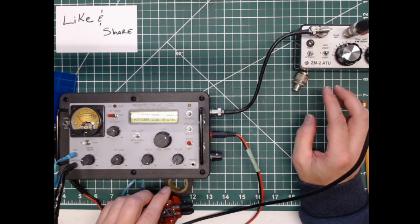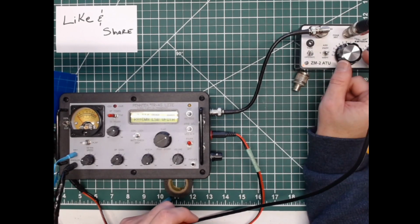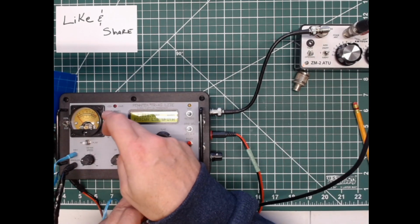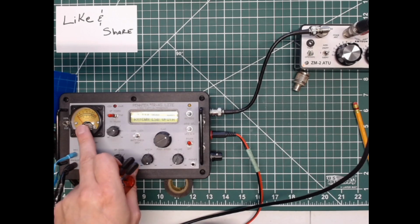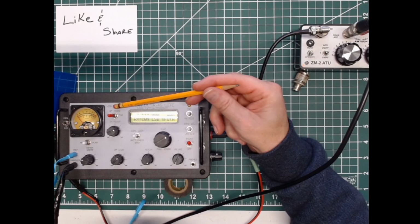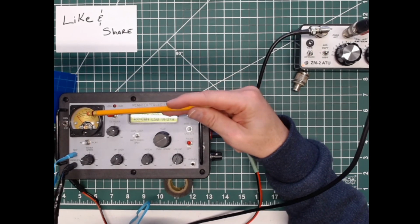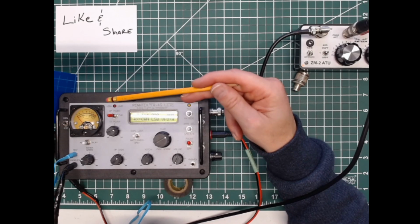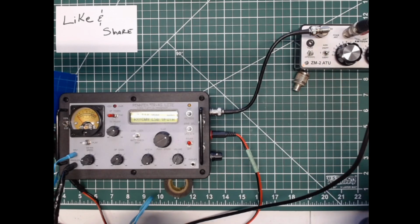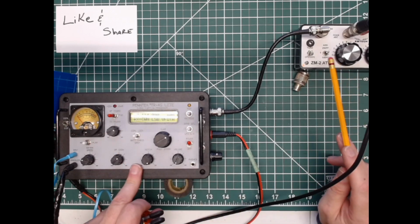All right. Well, so you get an idea there how I used the tuner. Basically, the light didn't go all the way out this time. However, I did notice that when I flipped my meter over to SWR and I keyed down, I was able to watch my meter over here, and it laid pretty flat. And again, this light will come on if it's over a 2-to-1, and then that needle right there will come up as well. But we noticed that my needle is flat, my light didn't come on, even though that light was on.